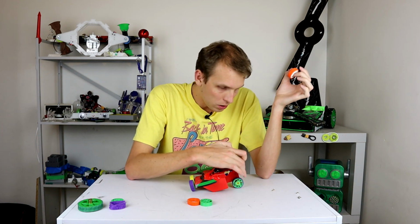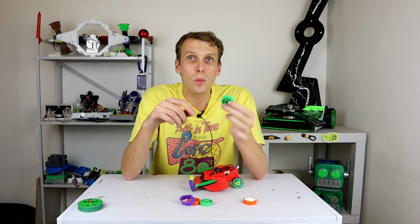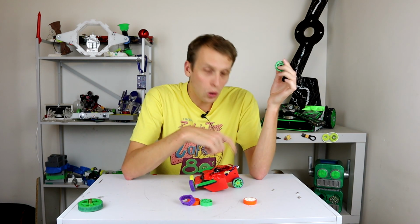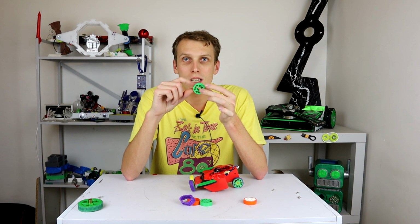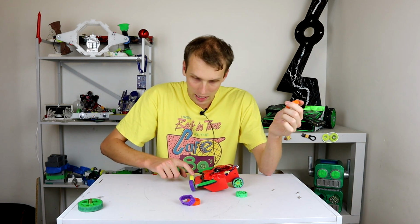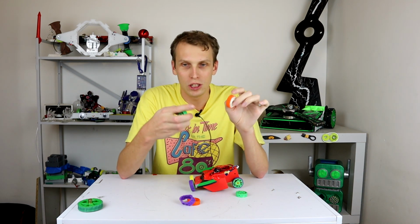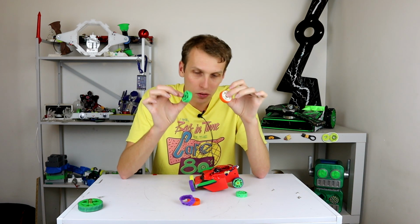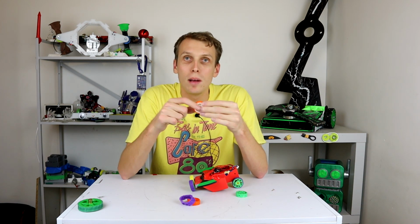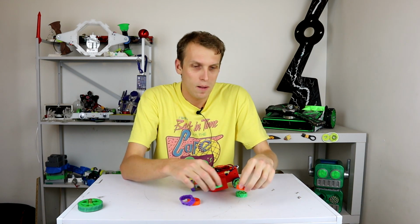And the mould version of this, the one that's actually on the test rig right now, is the way to go. Those holes through the chassis, through the hub, give the silicone enough grip that even in the high torque situation, the wheel did not come loose or come off in any way. Whereas everything else, the original version, the dual cast version, the default version, and the grid version, all came off under that high torque load. That constant skidding against the floor caused the silicone to loosen up and just boop, come off. Which, once again, is not the failure mode that I was expecting at all, but it's the failure mode we got.